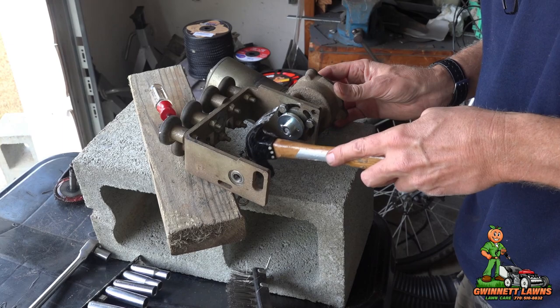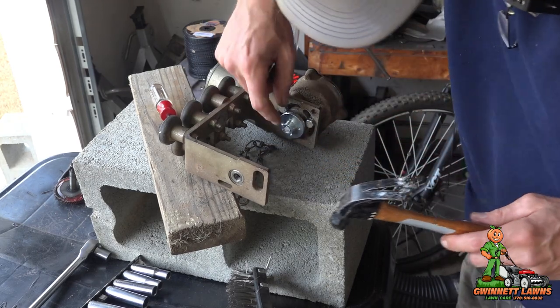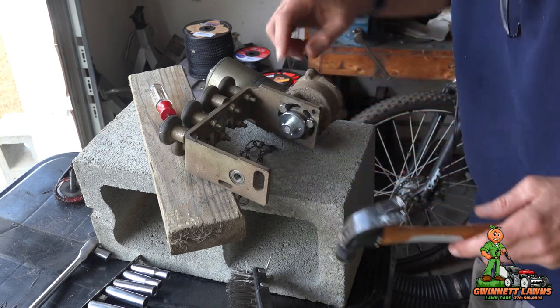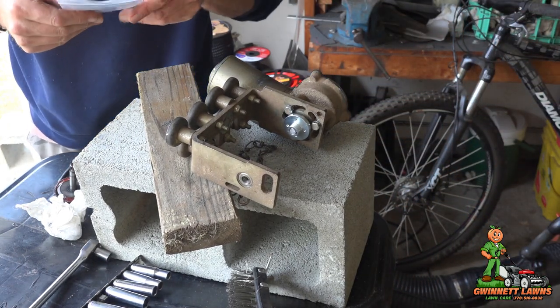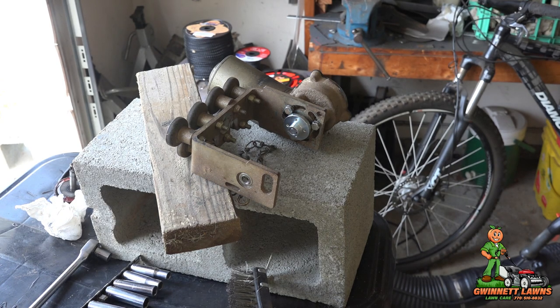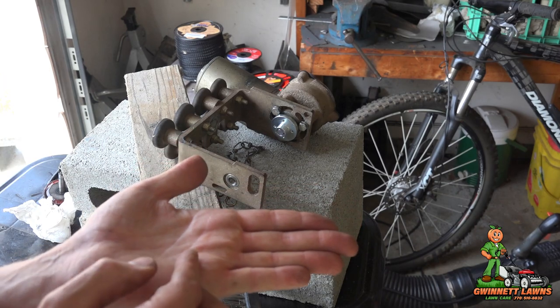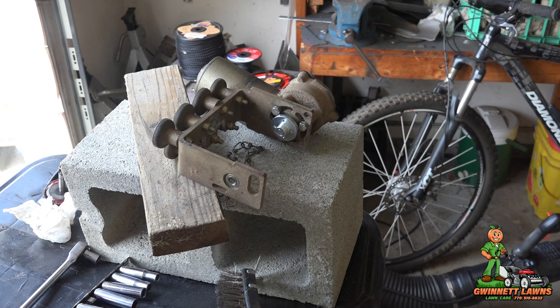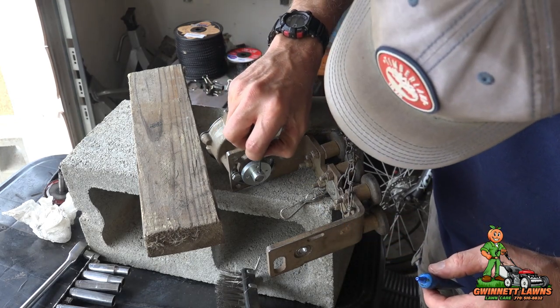This may go on without a fuss — and it does. It's very easy if you get that woodruff key set exactly where it's supposed to be. This shaft is supposed to be flush. So that went on really fine. There is a set screw on here, and you're supposed to use some Loctite — I think blue Loctite. It's just tiny, looks like a little tick. Let me put this back in the bag — I believe it was like a sixteenth of an inch. So we just put a little bit of Loctite on there.